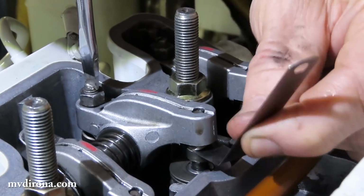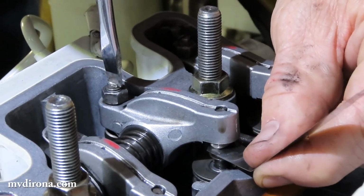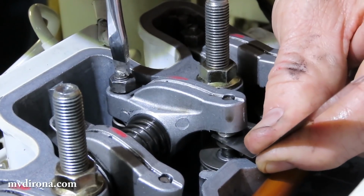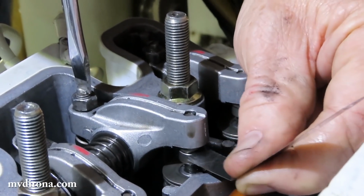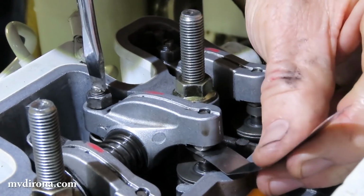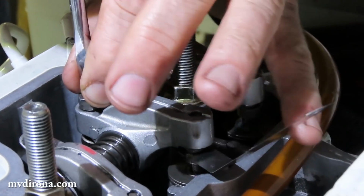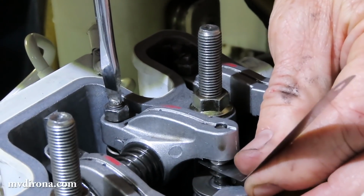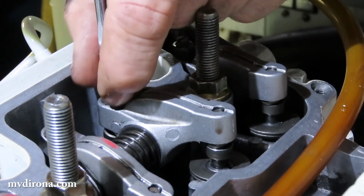You see right there, it's too tight. You can't pull it, and just a little tiny turn, and that's light friction, and that's too loose. So I just turn it up till it's light friction. So you tighten it down on it, and then try pulling out. Is that kind of the way to do it? Yeah, I find the right place by doing exactly that, and then I let it float back and forth as I am right now, feeling it going in and out, making sure I'm not pushing the valve open, and it really is correct. And if you're pushing the valve open, how would you tell?